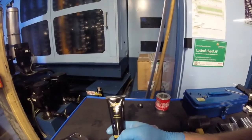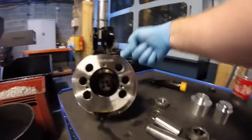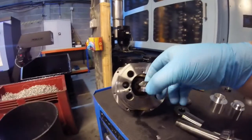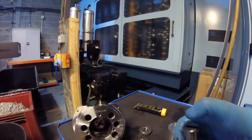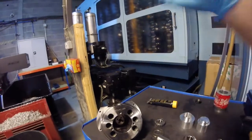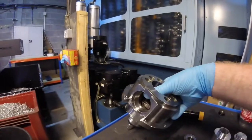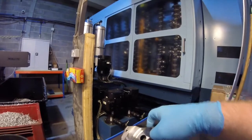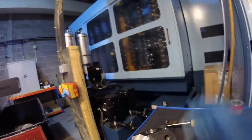I was recommended to use this particular grease because it's made for high speed bearings. The drive comes in from the back servo motor into this gearbox, meshes with the gear, sends the drive up the shaft, and then a dog engages the back of your driven tool to give you power. You've got two bearings: the big bearing on the drive end and a small bearing on the back. Gravity means any lube in there will eventually pour out, and then it gets overheated and dies.